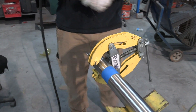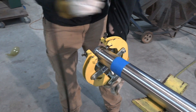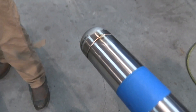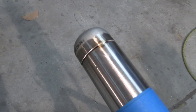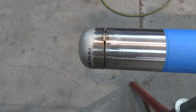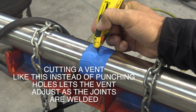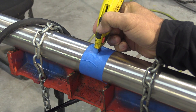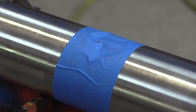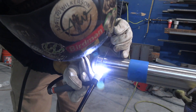As we close the ends up, we're going to have to make sure to have a vent cut in the tape somewhere so that pressure doesn't build up and blow out the weld — which I have done before. You just forget to cut a vent, or forget to place a big enough vent, or have your argon flowing way too high. What I like to do is cut either an X or a T instead of just poking holes — that way it'll hold the argon in just enough, just enough will escape, and as it closes up it'll open as needed so you won't build pressure.